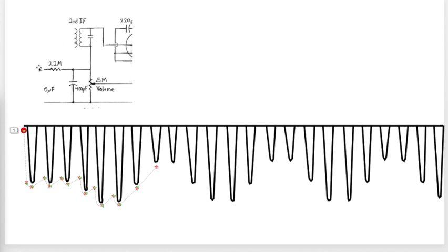And it just swings back and forth with the loudness, not necessarily with the frequency. I could say it's kind of a representation of the data as well, but it's smoothed so that it doesn't do the quick changes that you would want at the top of the volume pot. So over here we've got a smooth DC voltage that is controlling the bias on all the previous stages, and when a really loud signal comes in and this goes very negative, this side produces a very negative voltage, and it turns down the amplification of the previous stages. When this side is a very small voltage, this side goes a bit more positive and allows more amplification to happen. So this is our AVC circuit.